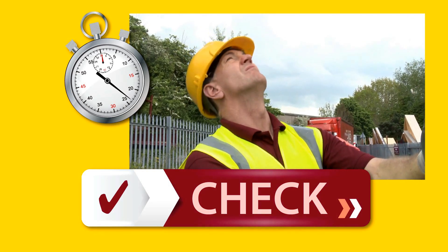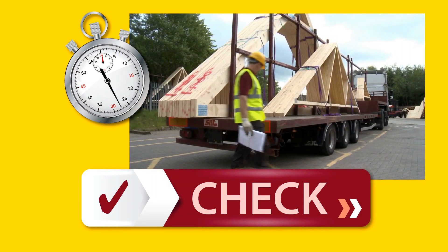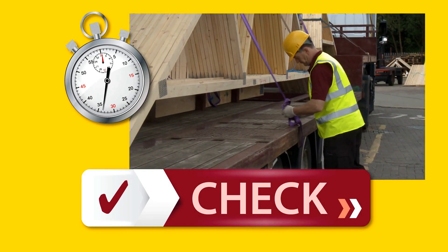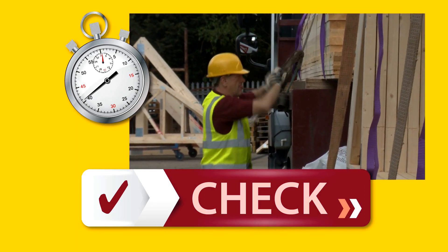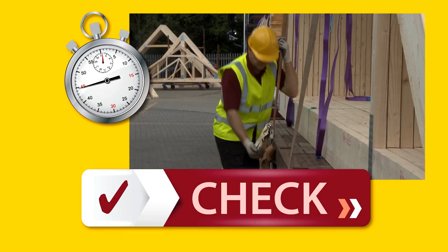Check the load height and update the board in the cab. Check the load's width and length, and also that the metalwork bags and slings are reachable from ground level, and tie off the slings when necessary. Finally, use sufficient straps to secure the load, and ensure that you have all the equipment you'll require for delivery, such as PPE, cutting pole and ratchet straps.